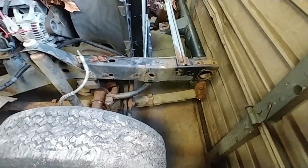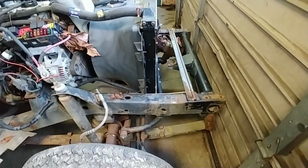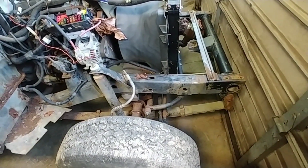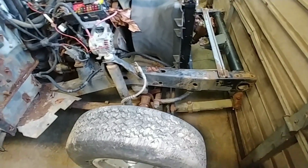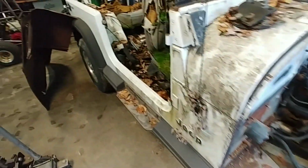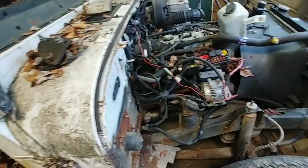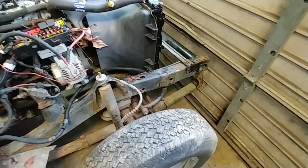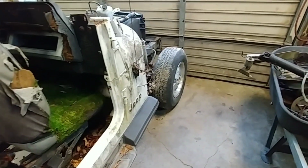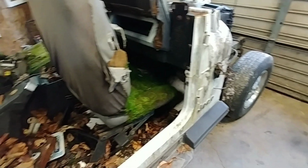And a couple of reasons I'm taking it is it's got dual leaf springs front and rear. What do you call that? Transverse? No. Parallel. It's got dual parallel leaf springs, just like the car he had. And it's a nice frame. So we're gonna use the frame off of this and the rear axle. I'm not sure on the front axle. We might use something else.